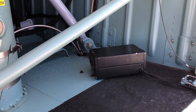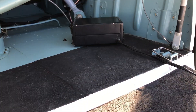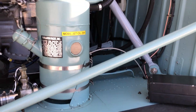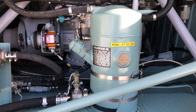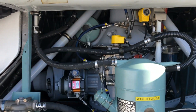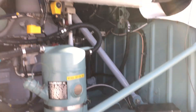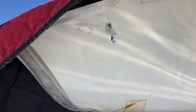For about the last hour I've had the machine outside with two electric buddy heaters installed, all plugged in here with the aircraft plugged into the hangar. This is warming the transmission area, which includes the engine oil reservoir, the hydraulic fluid reservoir, and all the fluid in the transmission itself. I'm going to close it down and put the cover back on to keep it nice and warm.